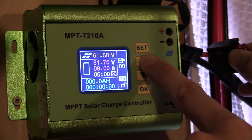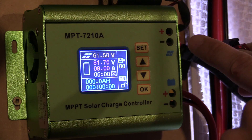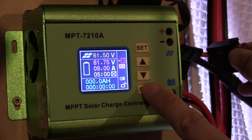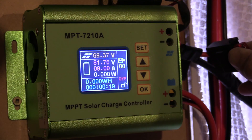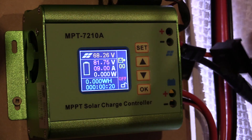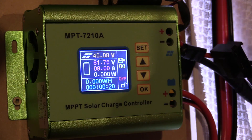What you do is press the UP key to turn it ON. Then — and this is the key thing — press the SET button, then press the OK button. Now you can test it: you can turn it ON and OFF. You can take away your solar panel voltage and it'll drop down in a few seconds and then turn OFF.